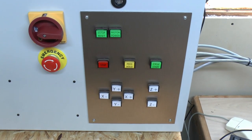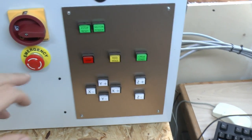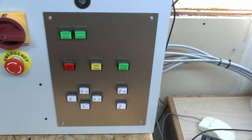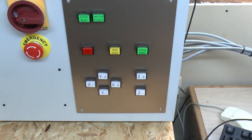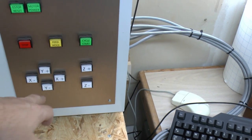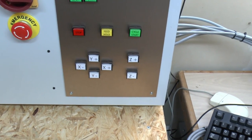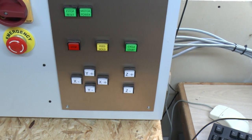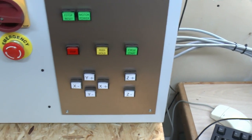Here's the front of the control panel, and you'll see I've put various buttons here. We've basically got three here for stop, feed hold, and cycle start — or in another way, stop, pause, and go. And then at the bottom I've got the jog functions, so basically two for each direction: X, Y, and Z, which is the height of the tool. You could just use them on the actual screen of the computer, but it's also quite nice to have them as a separate thing on the front panel.